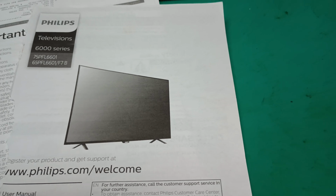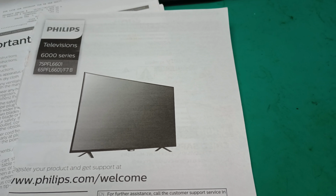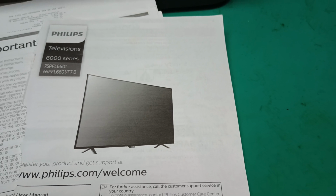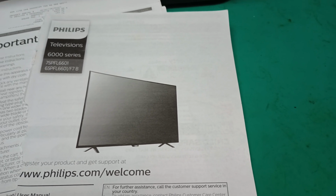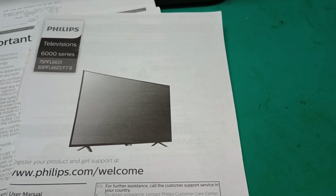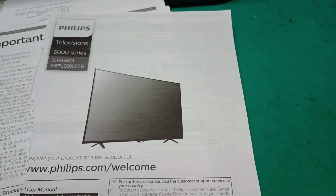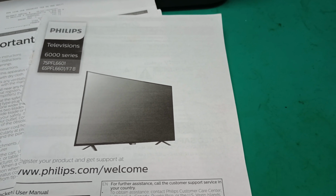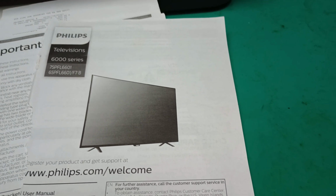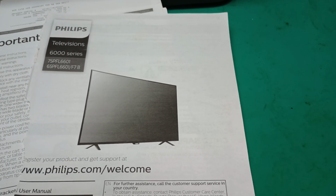This ground terminal thing came, in my experience, because I was there, from about the 1970s when solid state car radios and CBs came to be. That terminal on the back of the radio chassis was not there for ground. It was there for under dash mounting of a radio. The instructions were to put a perforated strap between the metal structure of the dashboard and that thing and tighten the nut down. If it wasn't there, every time the car hit a bump, the radio would bounce up and down and eventually break something. Not a ground terminal.